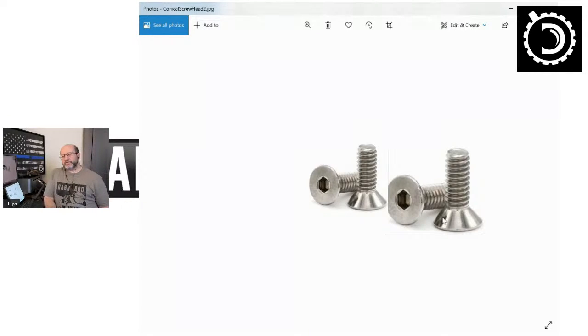It clamps on stuff very consistently. Cones are a good thing for a lot of different things, and it lines things up nicely and all that. However, if the holes through the top and bottom ring halves are not perfectly matched, as you're tightening a screw with a conical head, what will happen is that you will misalign the top and bottom half of the rings, right?